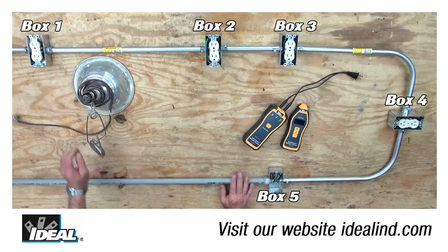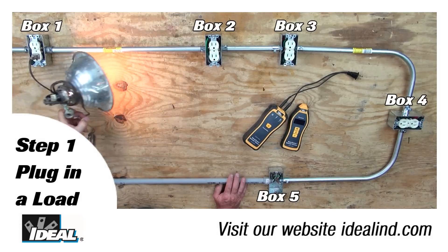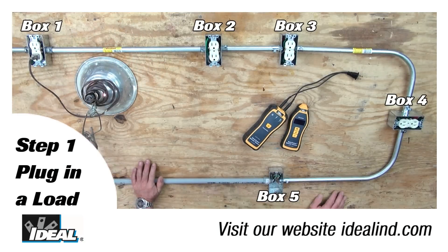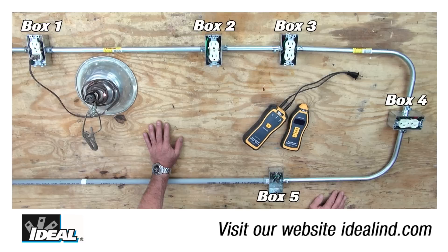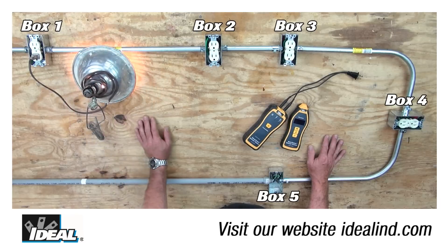Step one is to identify a working outlet nearest the breaker panel and plug in a load like an incandescent lamp. This provides a conductive path from the hot to ground via neutral so that it is not free to pick up any ghost signals. This effectively grounds all the conductors except for the open hot conductor in the circuit — this is the preferred way to find an open condition. If you do not ground all the other conductors, the signal will bleed into all the wires in the circuit and the odds of finding the open are reduced.